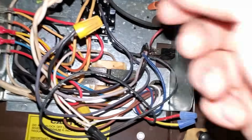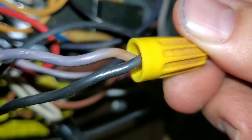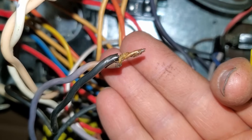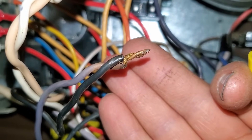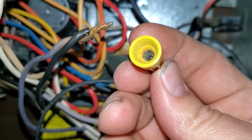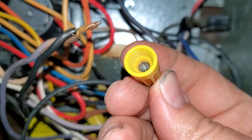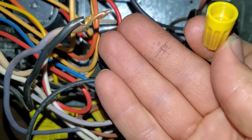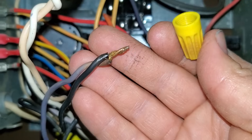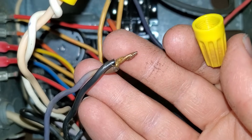Now if we look closely at this wire nut right here, what I noticed right away is that there was some discoloring happening on the insulation of the wire that goes to the actual equipment. I'm going to turn this off and take the wire nut off so you can see that we have it fixed now. When I first looked at this, that stranded wire was wrapped around the solid one, but it wasn't really engaging in the threads of the wire nut. If you don't get the threads of the wire nut around both conductors, it'll still be wrapped but won't be making a proper connection. And when you see signs of heating on your conductor or on the insulation next to it, you know that there was a little bit of arcing occurring.